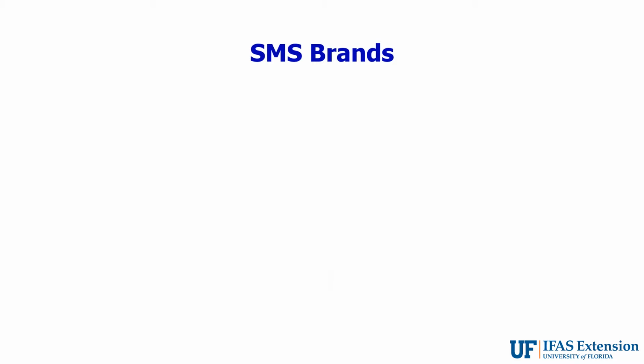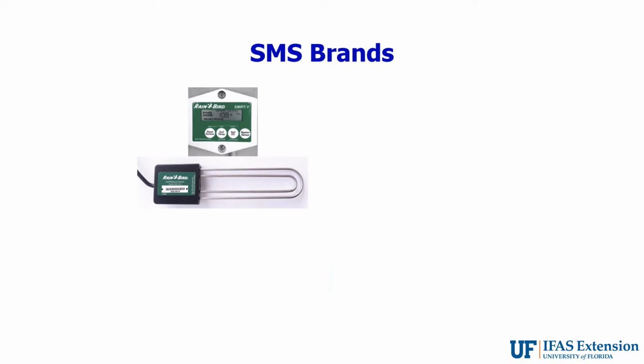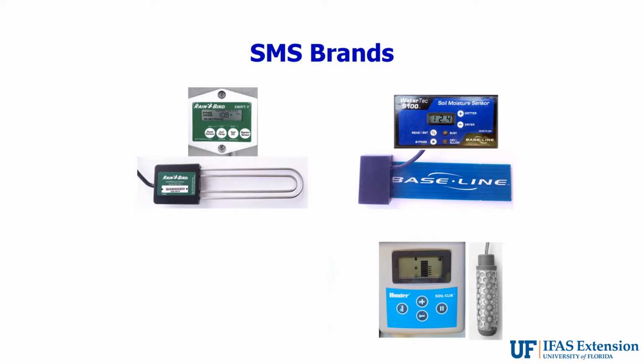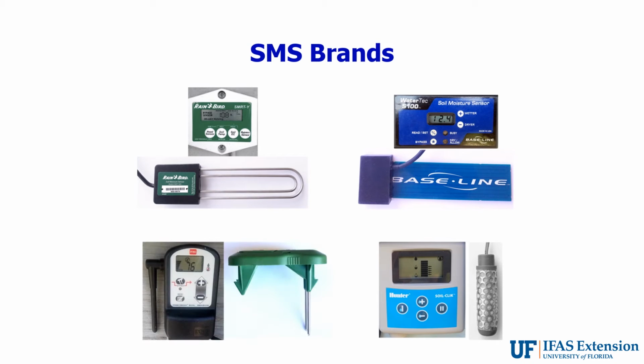There are several brands and models of soil moisture sensors in the market right now. For example, at the University of Florida, we have tested the Rainbird, the Baseline, Hunter, and the Wireless Toro. And there are some new promising ones that I'll show you at the end. These soil moisture sensors differ in the technology that they use to sense the soil moisture. But, as you may have noticed, all of them have in common two components, a probe and an interface.